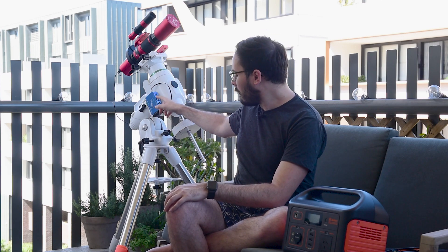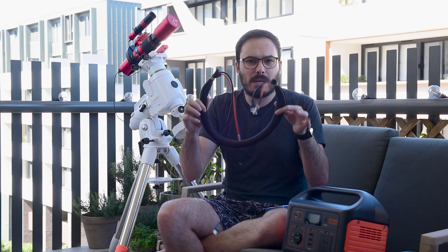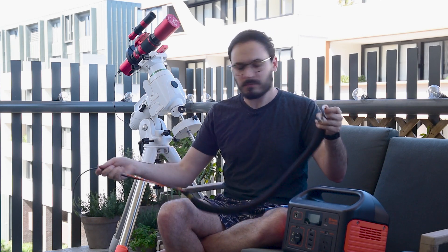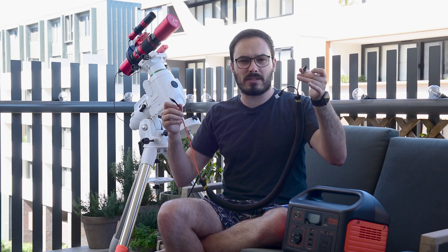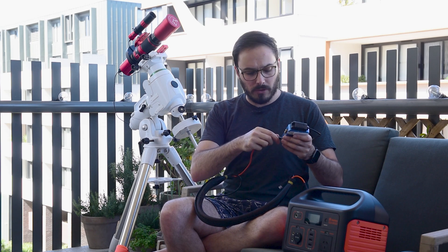There's only one cable that has to go from this power box down to the battery on the floor, and that keeps things really clean. So to start off let's connect to the mount — here I have my mount cables, wrapped using cable wrap from a local hobby store, which keeps everything nice together. You can make it to the size that you want, and if your cables are really long — like this one here is two and a half meters long and I don't need it that long — I've just wrapped it back and forth a few times inside the cover. I've got my data cable which allows my laptop to control my mount, and I've got this Lynx Astro power cable for the EQ6R Pro. This point connects to the EQ6R Pro head and this one has a DC 2.1 millimeter plug, so we simply connect that to one of the 12 volt outputs here, get the USB plug, connect that on, and then once I connect this to my mount, my mount would be connected and receiving power.